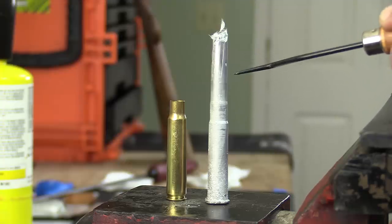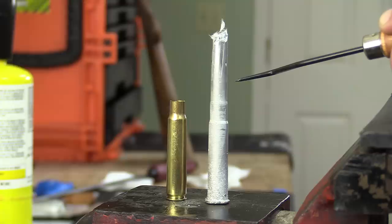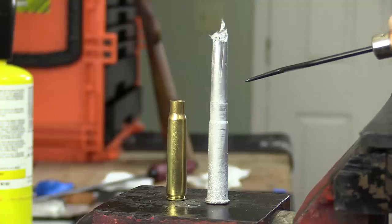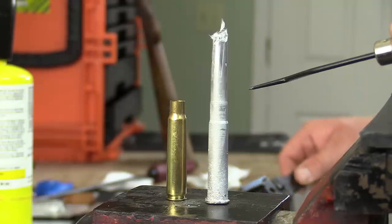I actually wound up taking about two or three different bolts out of various other guns that I have, the M46s, and testing to see if they would all fail the headspace check. And every single bolt, despite what gun I pull it out of, like a bolt that headspaces normally in another gun, still headspaces on the sloppy side on this particular gun, which tells me that it is obviously some issue. The hash mark on the bottom of the barrel is undisturbed.